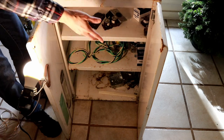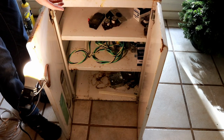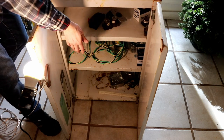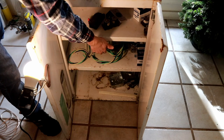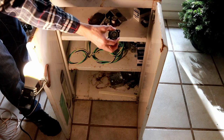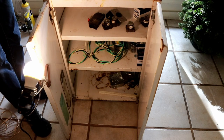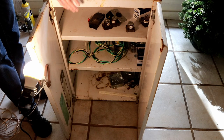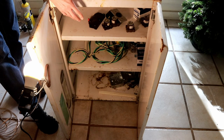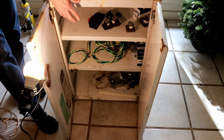I'll have to install some vent holes — probably not a huge amount of ventilation will be necessary because the enclosure is metal and will conduct and transmit heat fairly effectively, but I think having a little bit of airflow would be beneficial. The next level up is going to be the location where the contactors and fuses are installed. I have a few glass fuses and I'm going to be configuring two fuses on the incoming split single phase leads from the main panel.